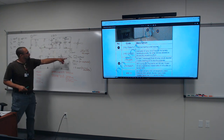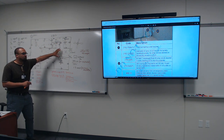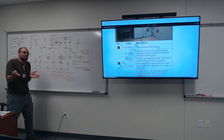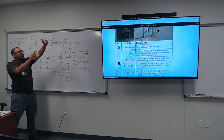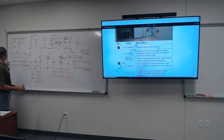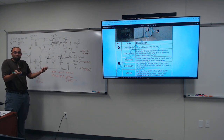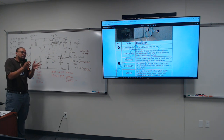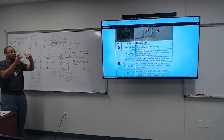So, the master bedroom: you got four, five. Now, this is not the end of all. Once we calculate this and start doing the lights, we can see if we have enough room to put the lights on the plug receptacles. Or you go to your panel and see, I didn't use five slots already, and if we're using a 40-space panel, you got 35 left. You have to know how many spaces you have left and determine if you want to put the lights onto the plug receptacles themselves, or on an individual circuit.